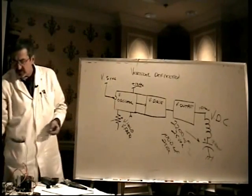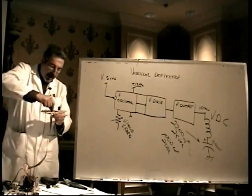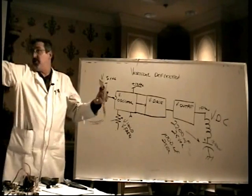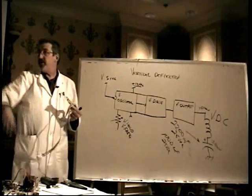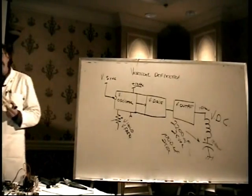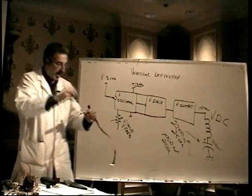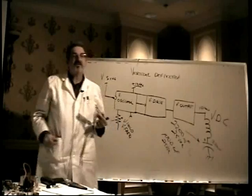So you say, well, there's a vertical size potentiometer on the remote adjustments board, so you just crank up the vertical size and it fills the screen. Beautiful, you're done. Close the machine up. Two weeks later, you look at that machine again. Wow, look at that thing. It's little again. Well, I know right where the pot is. Cool. Open it up, crank it up, and the picture's full.